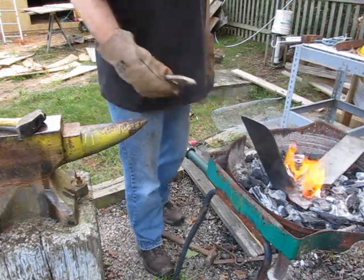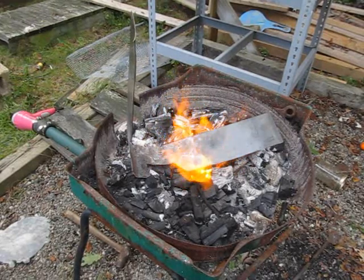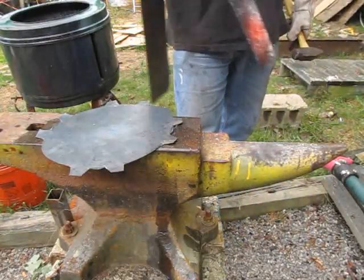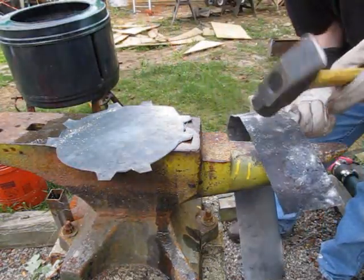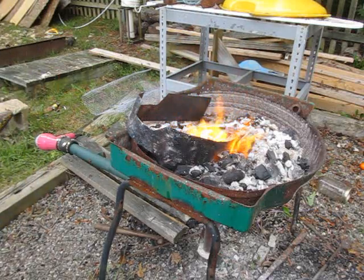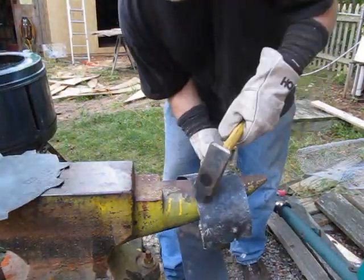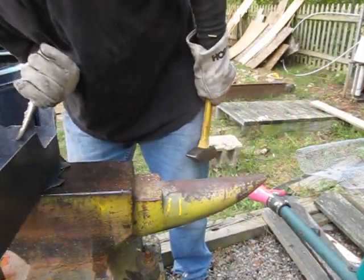Now that's done for putting the bifurcated line down the middle of the helmet — straight down the center of the face — getting that V-shape. Now we're going to curve it. We used the edge of the anvil to get that sharp edge, but we don't want a sharp edge for the curve. We want it to be nice and rounded, so now we use the horn of the anvil. I curve one side and then curve it some more. The most important thing here is I'm using the top of the helmet as a template — that red part still needs to be bent in towards the circle. So I put it on the template, see what needs work, and then bend it. The sheet steel is halfway decent to work with — it's a little awkward. So keep curving it: hammer a little bit, check it on the template, get it to match. We do this for both pieces — the eyepiece on top, and the bottom piece which is like the mouth guard.